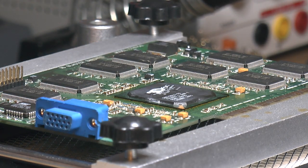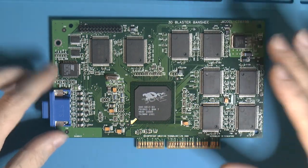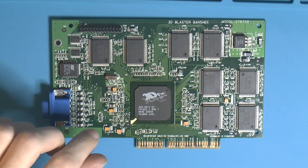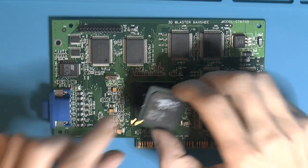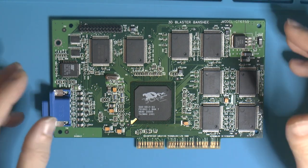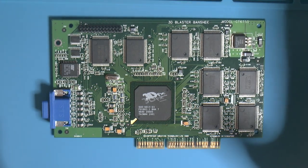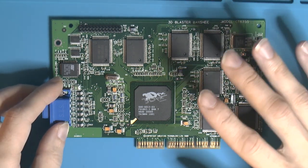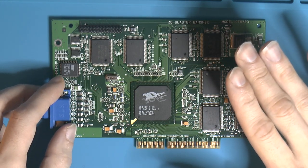And we're done. So here we have the card with the GPU on. I actually tried the card before with the shipped GPU, so we have it here somewhere. I think yeah, this is the shipped one. The card gave VGA dead beeps, and that motherboard doesn't like having no graphics card. Some will beep and keep posting, but that thing has post LEDs and obviously a PC speaker.